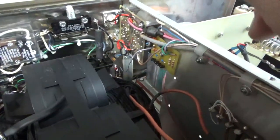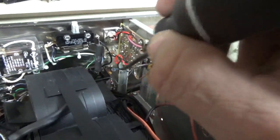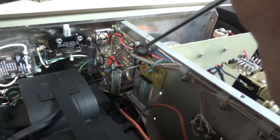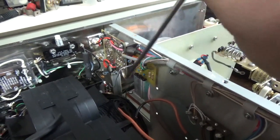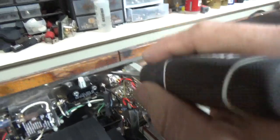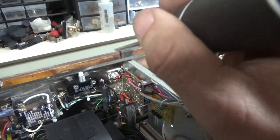I think this was put into an open, and I think it destroyed this board. I don't think this is the original board, because there was no solder on the trace for this lead that goes down to the rheostat — no solder on the backside. It's a one-layer board. I think they just saw the damage to the rheostat and left the lead hanging, which was not a good idea. Replaced the two SO239 connectors with two quality ones from Max Gain Systems. Alan Bond and his son are good people over there.